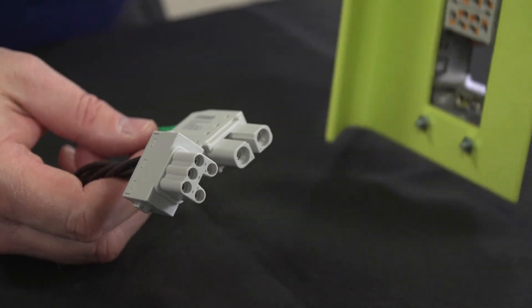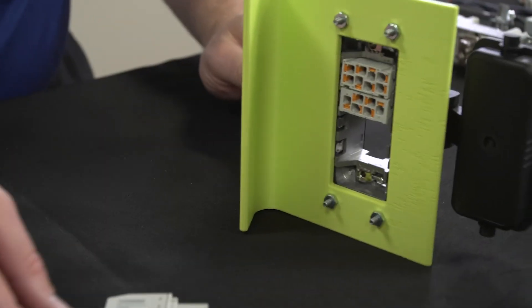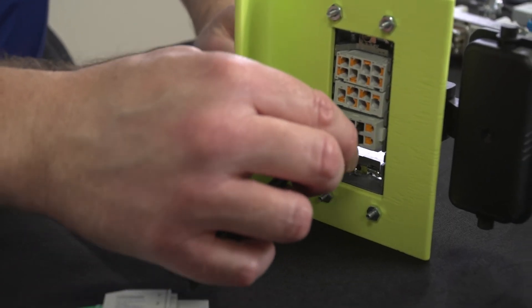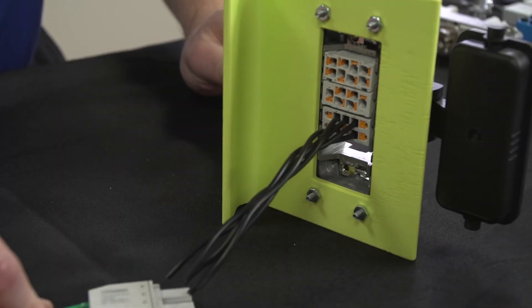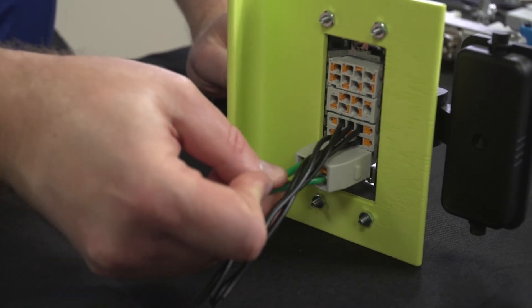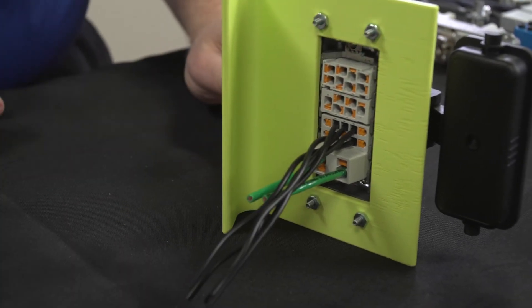From there, you can terminate and install individual modular inserts into the frame from inside the cabinet. This is most convenient if you find it easier, or necessary, to install your wiring in the modular insert before locking it into the modular frame.